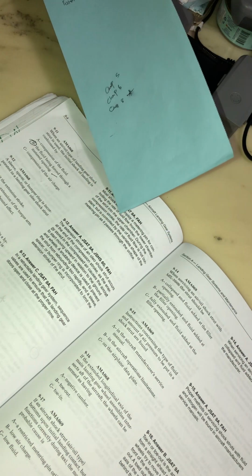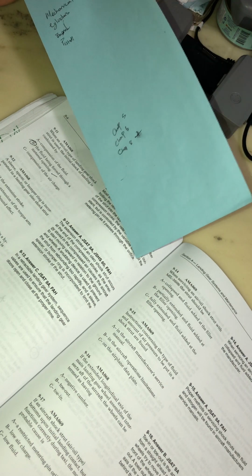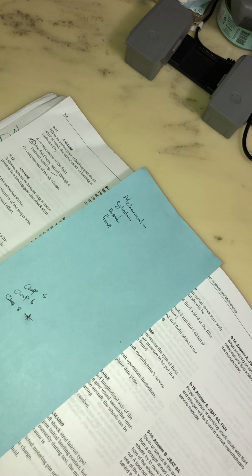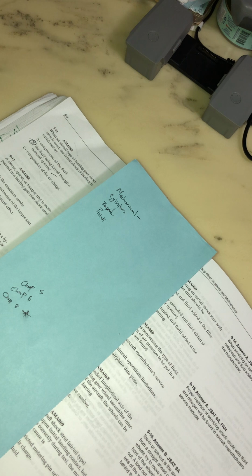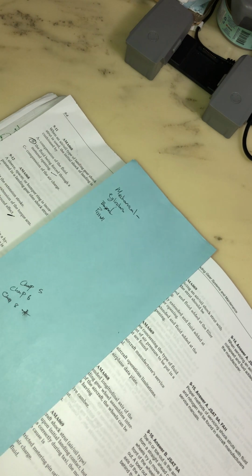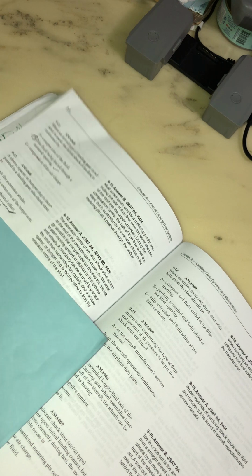What it says? During compression stroke, the rate of fluid flow is not constant, but it's controlled by the variable shape of the metering pin as it passes through the orifice. Next. A sleeve spacer or bump ring is incorporated in the landing gear shock strut to limit the extension of the torque arm, or reduce rebound effect. Now this right here, let's check what we got. I wasn't sure. This is a tricky statement right here.